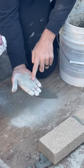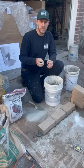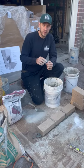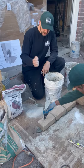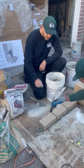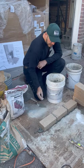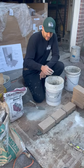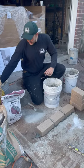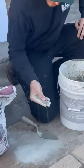Those grits aren't the best because those little grit pieces will allow air pockets around, and the mortar joint won't sit real tight and nice and neat and clean. We want our mortar joints to be 1/4 inch thickness. Some historic houses, they're even tighter, like 1/8 inch. These are just teeny tiny. And mixing it by hand with this nice, really fine stuff allows that.